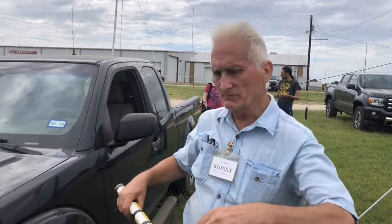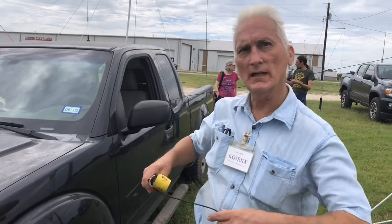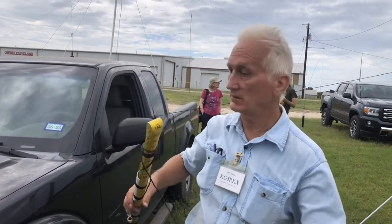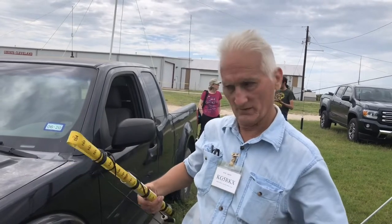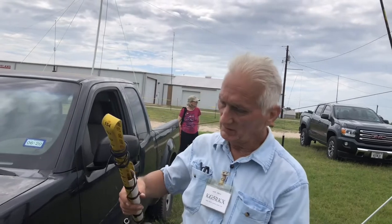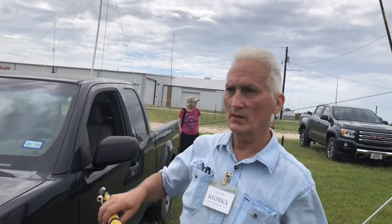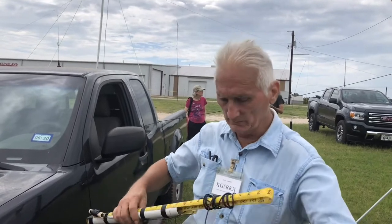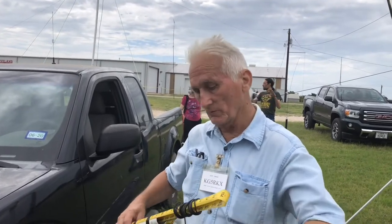There's not really any information on making them out of tape measure — this was just kind of hitting on it until we got it right. That's what amateur radio is all about. There's lots of stuff on copper tape J-poles, and even twin lead — the 300-ohm and 450-ohm twin lead. I made one of those too and it works just as well.